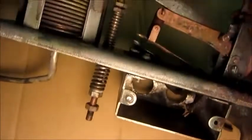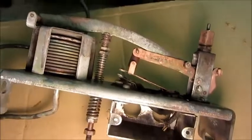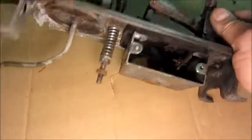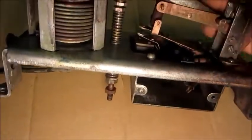That was put in the ultrasonic for 30 minutes using ZEP purple degreaser, which is caustic, at 60 degrees centigrade to get it clean. This is very well on its way to being put back in service if necessary. Because it was washed in water, I'm going to oil all the pivot points before I put this in storage. I think that new ultrasonic cleaner does a very good job — I'm very impressed with it. This control was a sulfur dioxide machine control, and I'm sure some of this discoloration is due to leakage over the years. That's just the way these look. Thanks for watching.